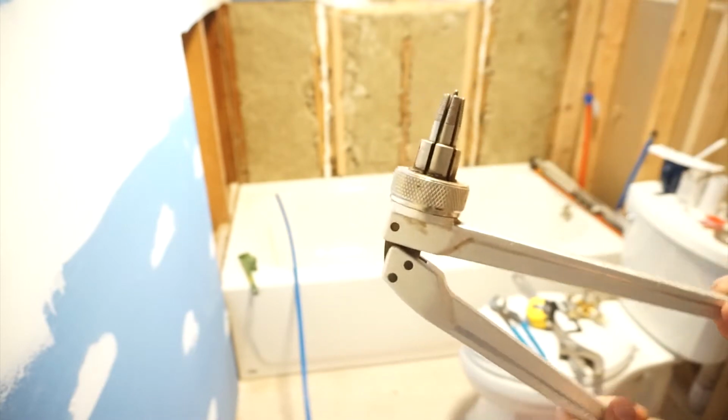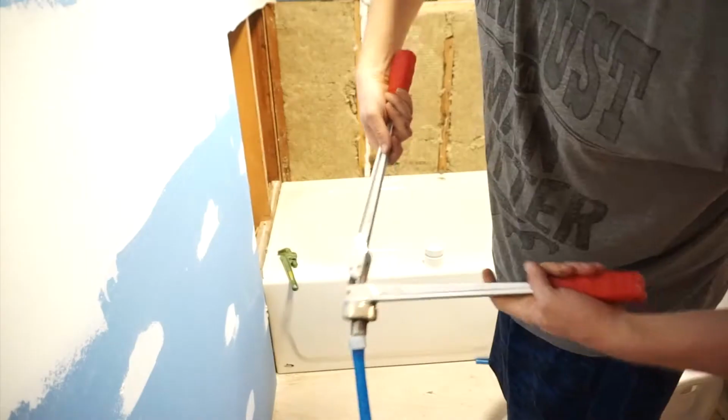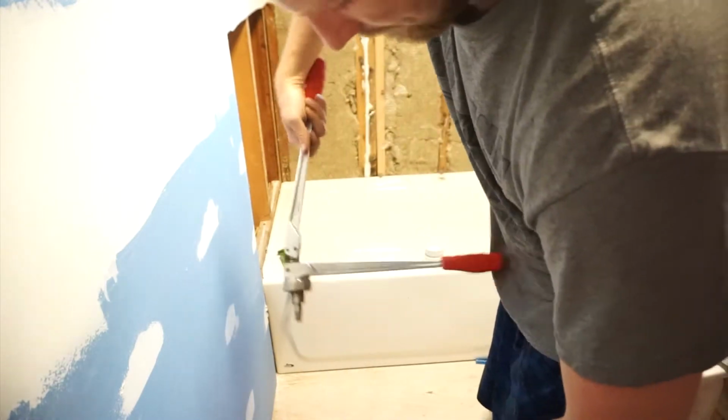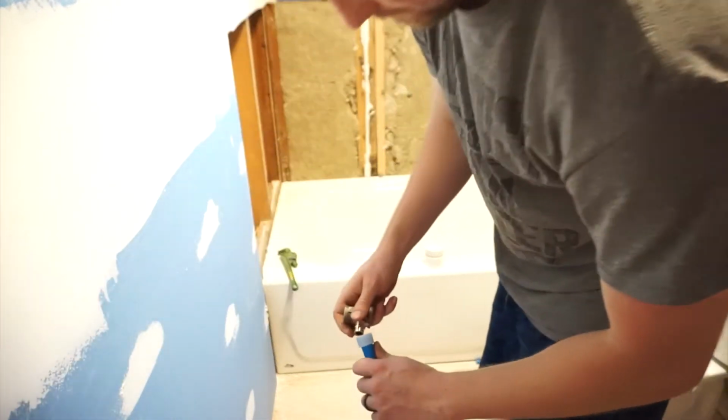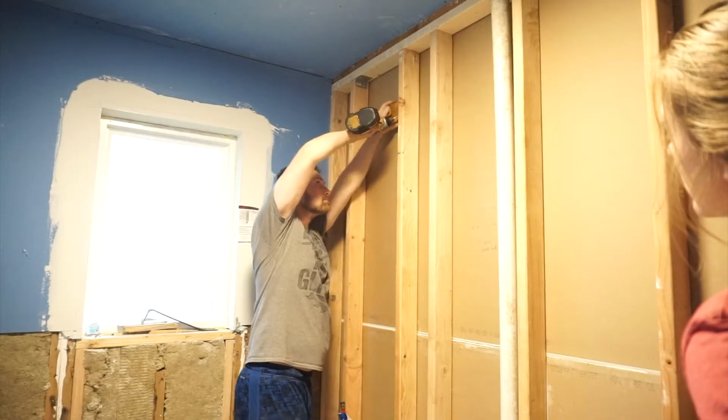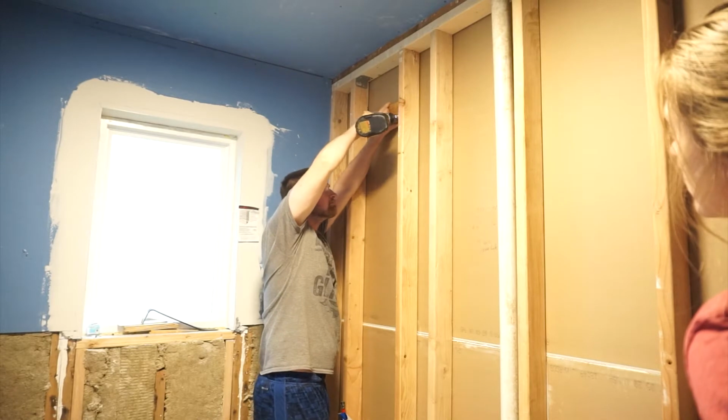The plumbing for sink, shower, and toilet in this build is going to be very simple because we stubbed everything out in PEX beforehand. For my build, I did all PEX type A along with a Moen valve set. I got brass fittings from a local plumbing company so that I can do my stub outs from the wall coming through with brass tubing.